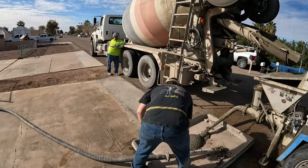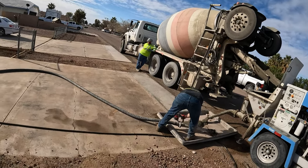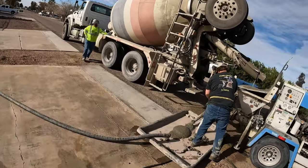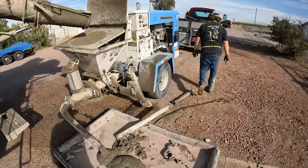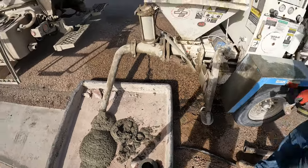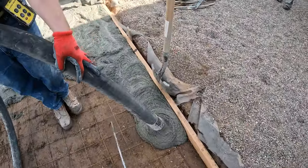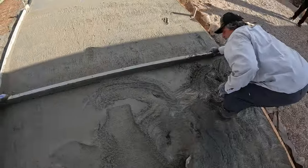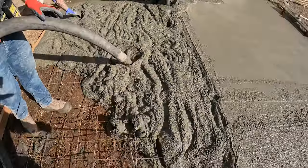When you get into manifold clogs, that's more time-consuming and a bigger mess. So now he's breaking off that reducer — that's typically where clogs are. As he's looking down the pipe trying to knock the concrete out, he notices a big chunk of debris in there. You can see it right there — that's what clogged it up. It could have happened in the mix and slipped through the screen, or more likely it was something in the pump that broke free and came down the hose. It only took about 15–20 minutes to get that pump running again.